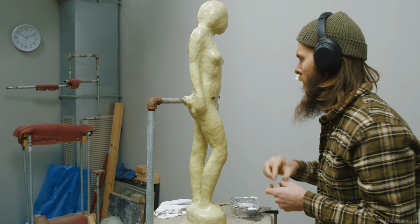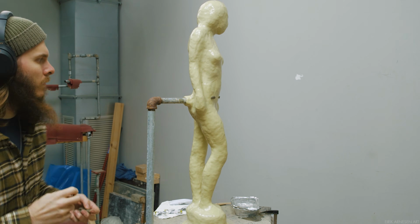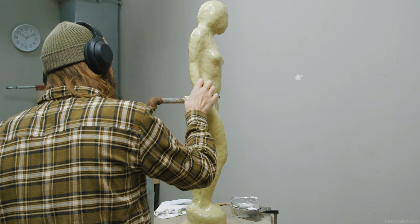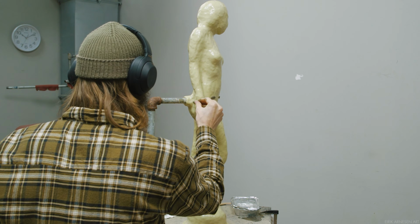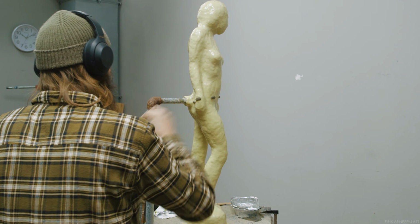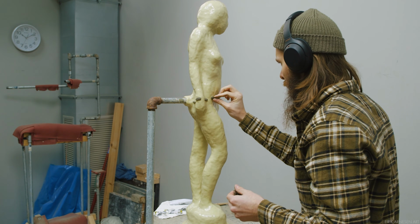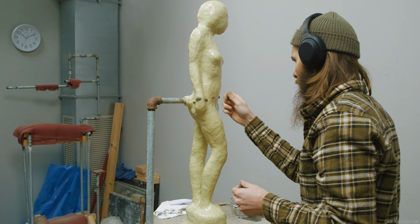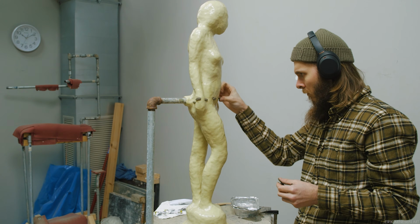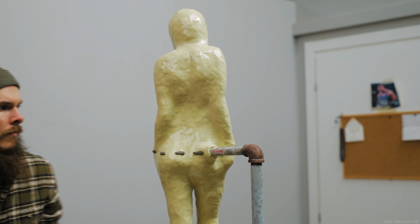The general rule of thumb that I go by here is that from one chosen viewpoint, one chosen perspective, I must place my silicone wall along the horizon of my piece. In other words, right on the high point where the form of my sculpture disappears from my view. Imagine that you have a hard sphere and two hollow pieces meant to cover the sphere. These two pieces need to be separated right at the high point of the sphere, right in the middle, the widest point, otherwise they will lock onto the sphere and never come off.